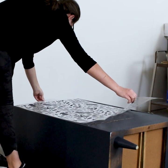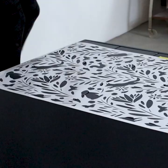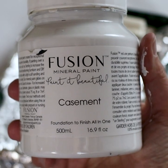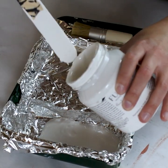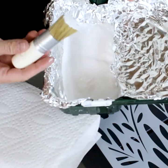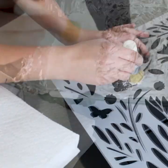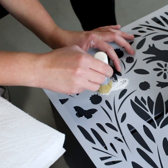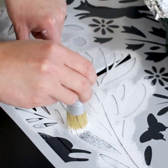I just positioned it on the edges of the dresser and taped it on the other side. I used Fusion Mineral Paint in the color Casement and poured it into a paint tray. I got a little bit of paint onto the end of a stencil brush, then dabbed some of that off onto a paper towel and lightly stippled the paint onto the stencil. It worked decently well, but it took a long time.